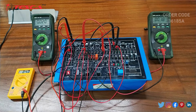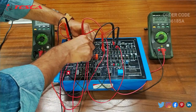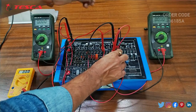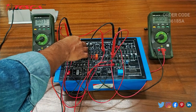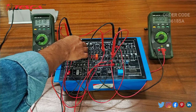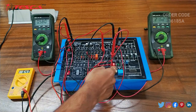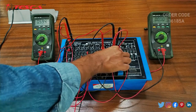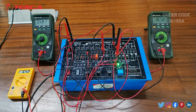You can see this property on the LED also. Just change the port of this 1K resistance to the LED. When the SCR gets fired you can see that the LED is glowing — this shows that the SCR is conducting. You can check it for another LED also — just change the port to this LED and you can see that this LED blinks. So this shows the property of SCR and that is how this experiment is performed.